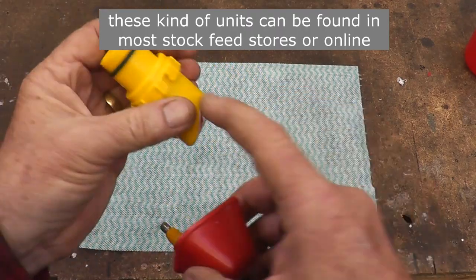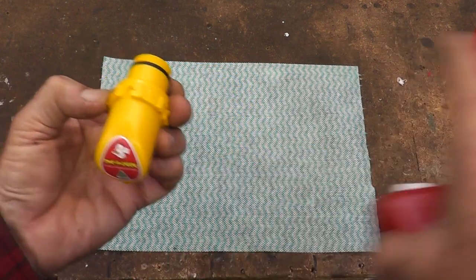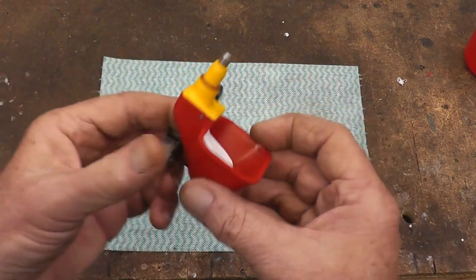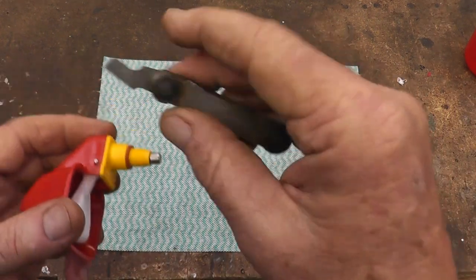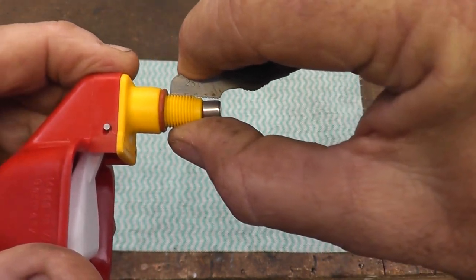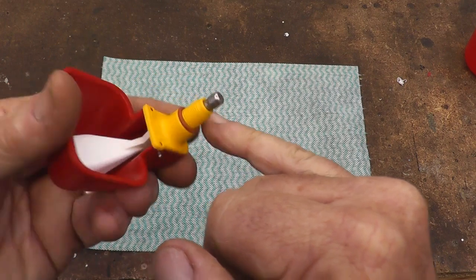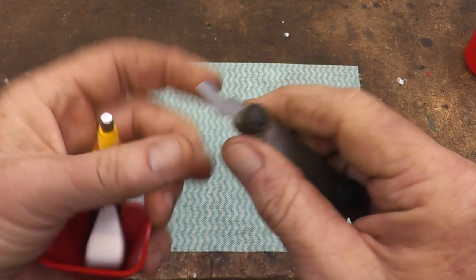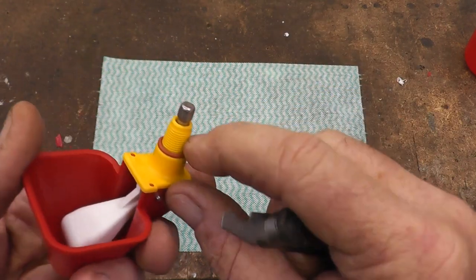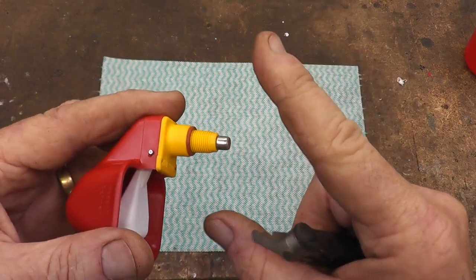This is quite a good brand. It comes with a fitting that allows you to screw it into a 20-litre drum so the water lasts a lot longer. I used my trusty thread gauge and found the threads are 28 threads per inch. Looking at the outside diameter - just under 10 millimetres - that's a 1/8 BSP thread, which is 28 TPI and 9.76 millimetres. If you can get hold of a stainless 1/8 BSP nut or fitting, that's great.